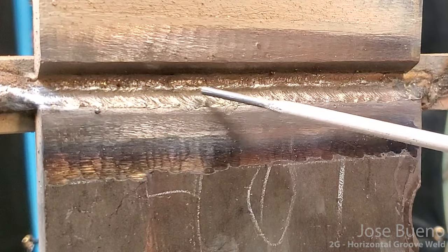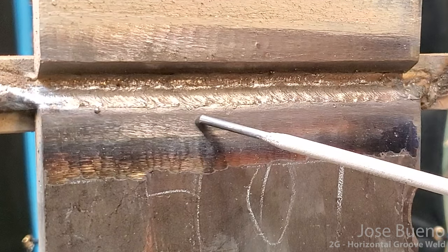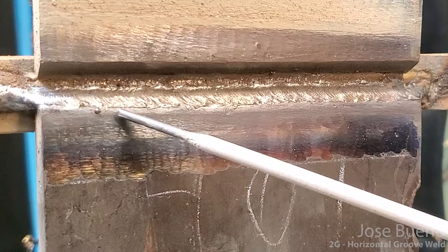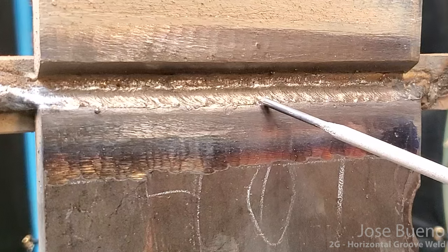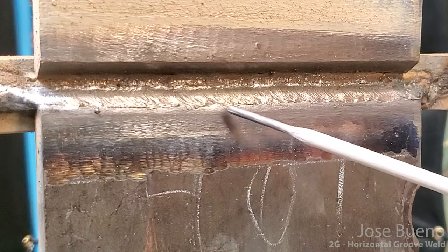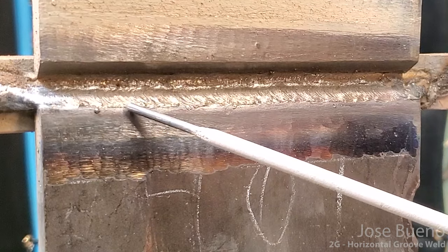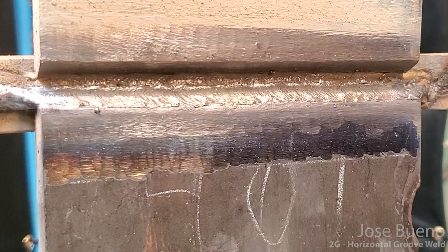So if this weld were to go too far over that corner, over this edge, it would make depositing not a perfect cover weld, but a desirable cover weld. It would make it a lot more difficult, because now I have part of another weld that I need to cover while coming up and covering this top plate. So it's putting more reinforcement on top of extra reinforcement, and we want to keep our weld from hitting that point where it's too much reinforcement.